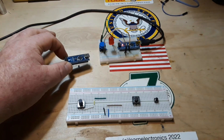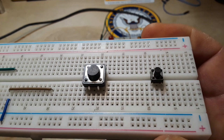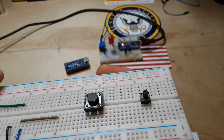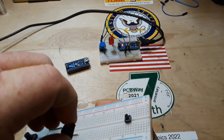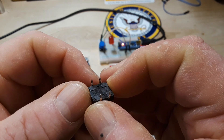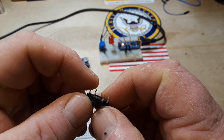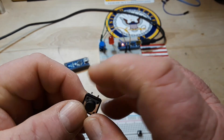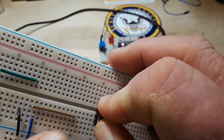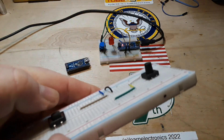Again we'll be using the Arduino Nano, but basically any Arduino is fine. What we're gonna talk about are these guys here — tack switches. I'm sure you've seen them all over in electronic projects. They're really easy to use, they're simply a switch. A couple things to keep in mind: these switches have four legs. They have a set that are spaced widely apart and a set that are spaced narrowly apart. Generally when you're using these with a breadboard, you want to clip them with the narrow legs on the same side of the breadboard chasm.